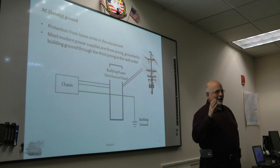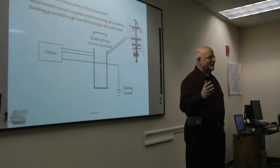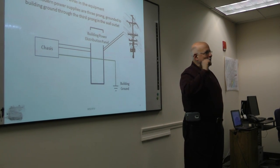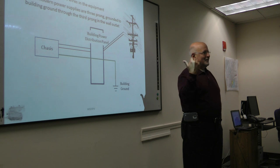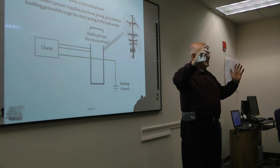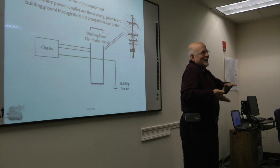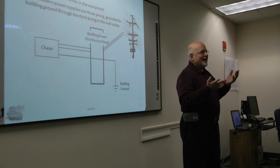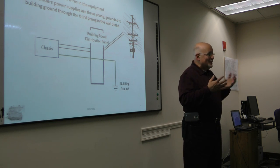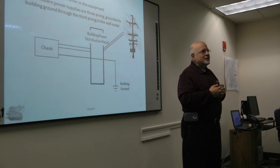For example, I must have spent 15 years staring at the ground for my house and thinking that it was just a ground wire for Cablevision. It was a fairly thin wire going to a ground rod that was probably at least 8 inches long, in the ground sort of at a slant, so it wasn't more than maybe 4 inches under the surface. I just thought that must be for Cablevision. One day I realized that it wasn't connected to Cablevision, it was connected to CL&P's wires. I had an electrician come in and check. He said, no, that's your building ground, and that is so far out of code it isn't even funny, and so unsafe. So it's something you should have checked.